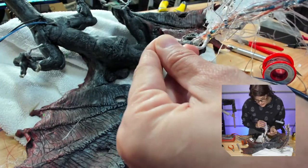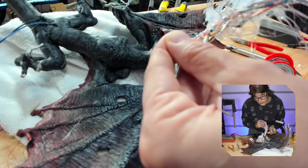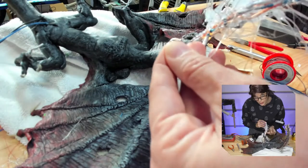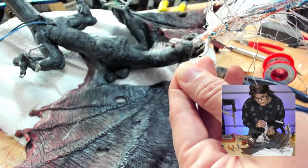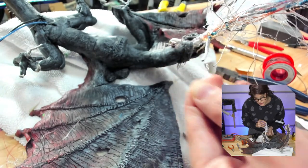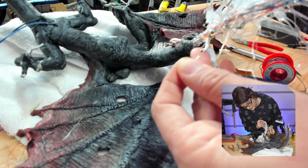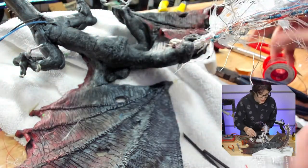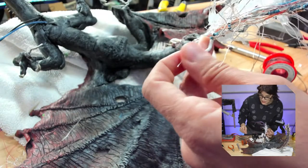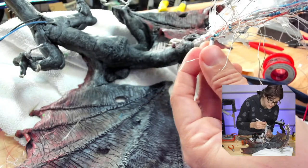Oh, it is. Look at that. Now it's on, now it's off. So either it's a short or there's a broken wire somewhere. But yeah, I'm thinking it's probably a short. All right, so I think also what I'm going to do... Yeah, now they're all on. Yep. Something's touching or something... I don't think it's a broken wire because then both of them wouldn't have come on at the same time. I highly doubt we have two broken wires.